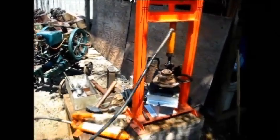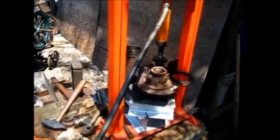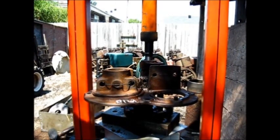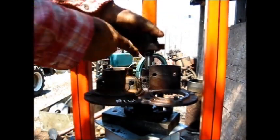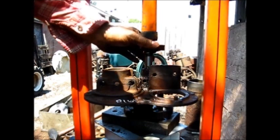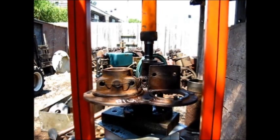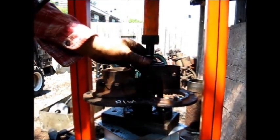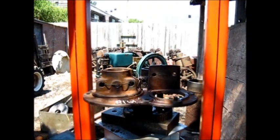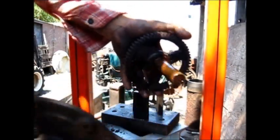As you can see yonder, we've got the porta-power up in there and we're going to get that pushed out of there now. I can see I have already pushed the shaft out beyond this gear — just got about a half inch to go and it's really tight. We got her out of there. So let's let the porta-power go. Set that aside — the gear, the spacer. And we got her out of there.